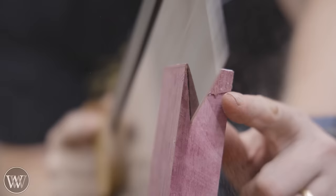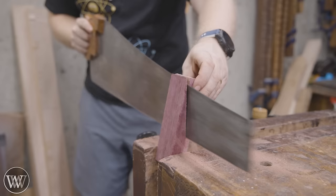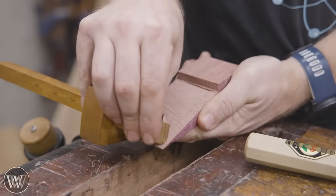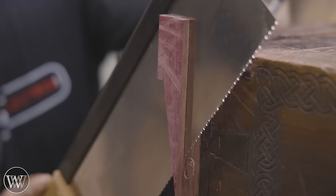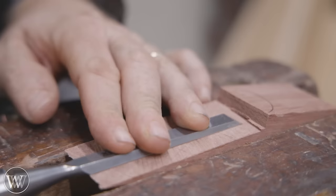This is the tip of the plane, and we're going to be cutting back. I'm not going to cut all the way down — just back whatever the length of the iron is so I have that little ledge back there. But I want the plane to actually go back into it, and the back of the plane is rounded, whereas the back of this slot is not. After flattening out the sole and figuring out what I want, I've realized it's actually a little wider than I need it to be. So let's rip this down again, because my first measurement was apparently wrong.